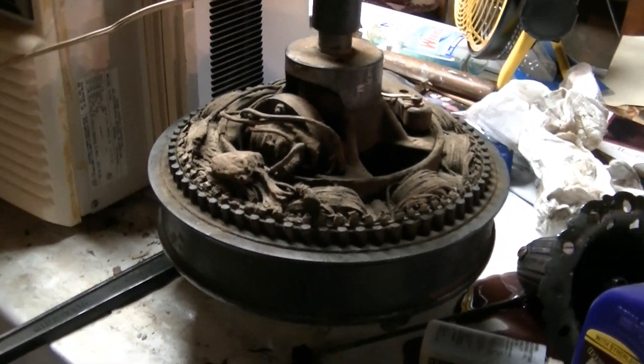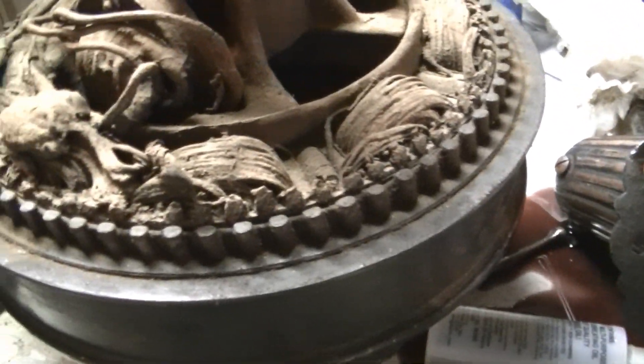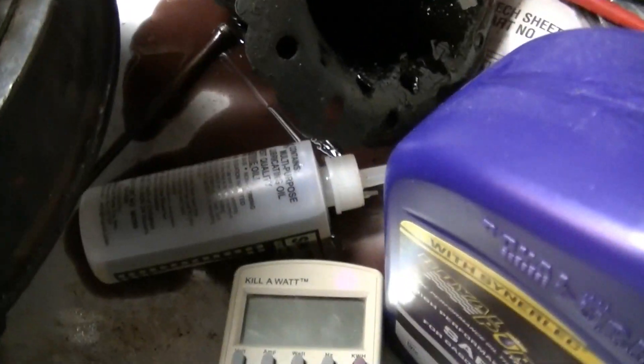Here's the century fan that was really stiff. It's really hard to turn because the lubrication is kind of gummed up. I took the oil cup off, which was sitting up straight before, and now it's tipped over and got oil all over everything. But I took the bearings off the bottom of it.